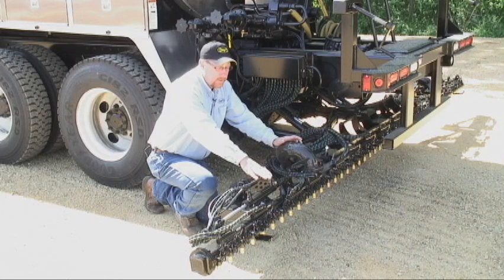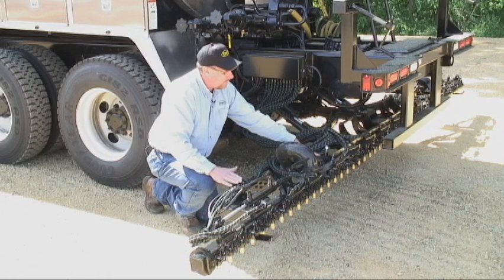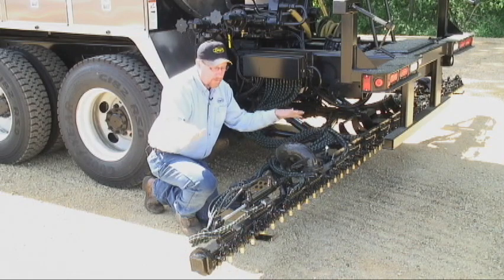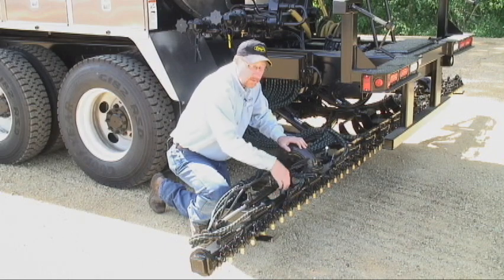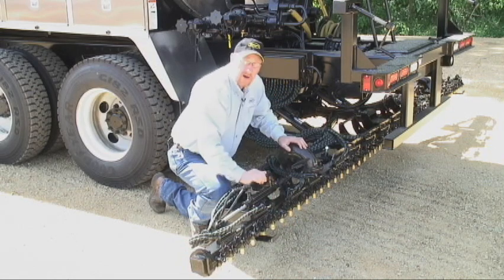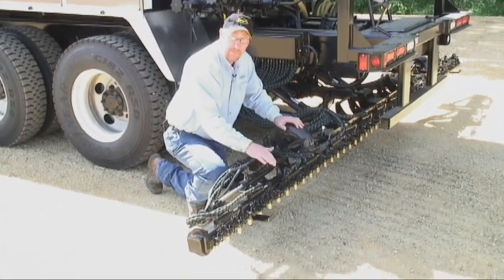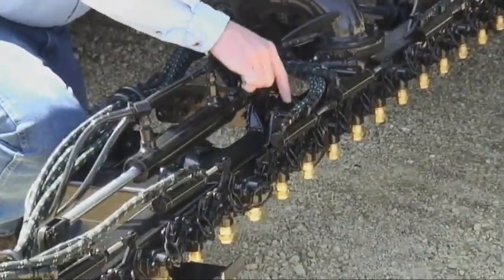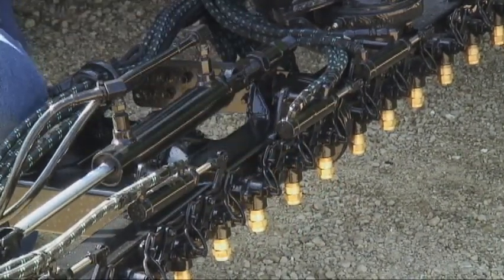This bar has a bi-fold, which we call it. It has two sets of folding joints — one cylinder here and one here. We can crown the spray bar by the adjustments on the cylinder. On our spray bar valves, we have three nozzles for every one foot. We can physically turn off some of these valves. In some instances we might want to do that if we were shooting tack or something like that to save from changing different nozzles. But in normal operation, we would want to get triple overlap coverage — we would want all three nozzles engaged at all times.